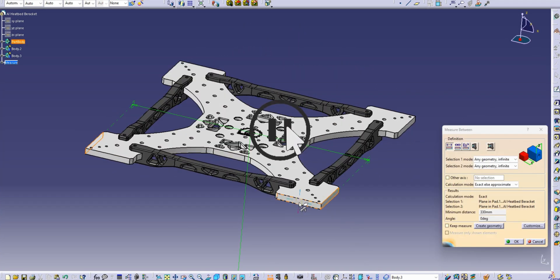Before we check the z-build system, the gantry I had used for the y-axis of the machine was causing small vibrations due to the inappropriate design of its geometric shape and 3D printed parts. This issue showed up on the outer wall curves that were printed in the direction of the y-axis and caused a lot of surface artifacts. So I decided to redesign this gantry and make it with an aluminum plate instead.